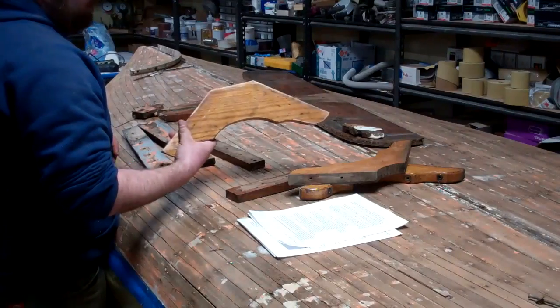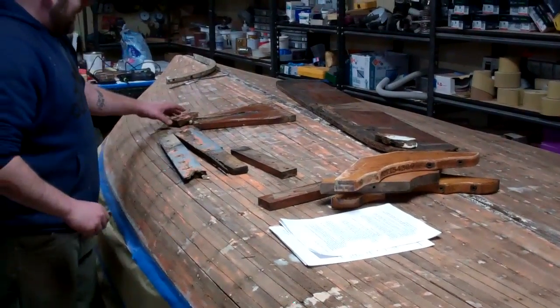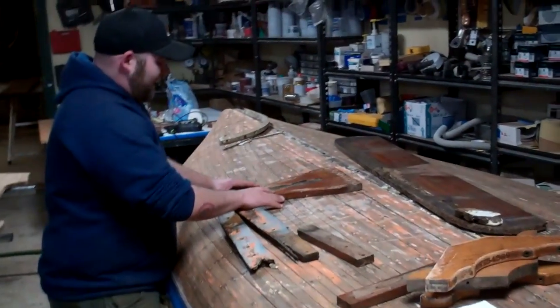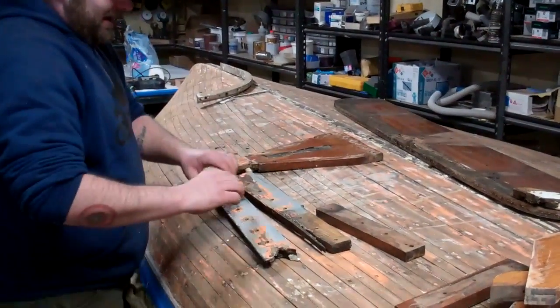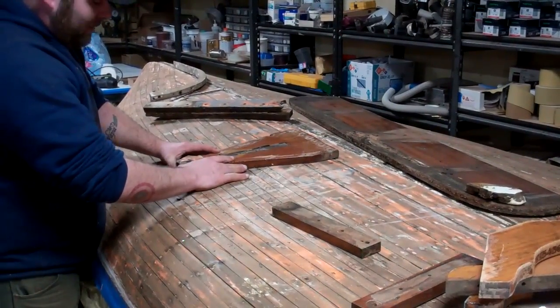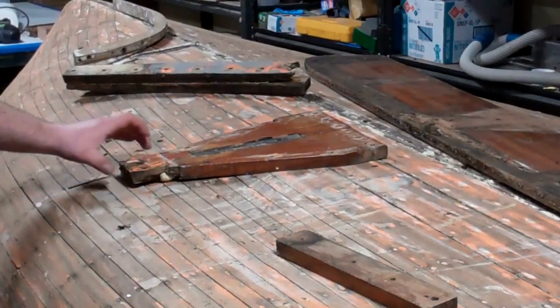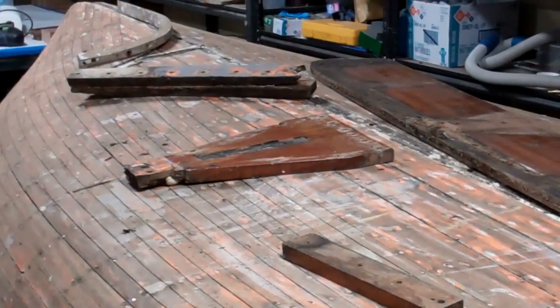Actually, there isn't any at all. So we'll be able to sand them down and refinish them. This one here, we're going to have to remake too, because it looked like it had 3 Dutchmans in it. And it's definitely not going to hold up again, so we're just going to fabricate a brand new one and get that put in as well as soon as the transom's in.